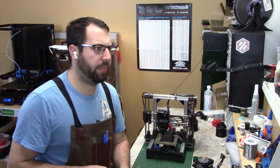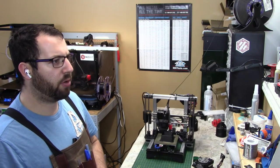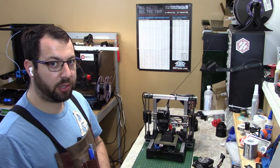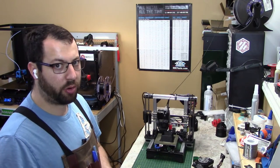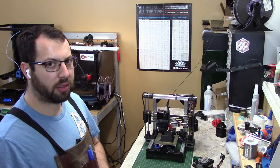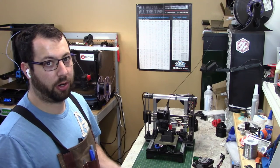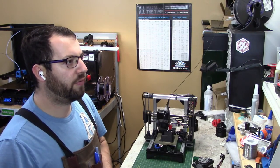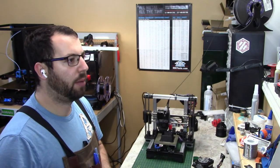Should I upgrade my Prusa Mark III Bear clone to switch wire or save up for a V2.4? Upgrading it to a switch wire, which is an upgrade, hardware-wise, isn't much. It's mostly printed parts and bearings. If you're reusing your bed, you would need to buy linear rod or linear rails, but you're buying some good hardware. It's not as expensive as building a scratch build V2. And it gives you a good introduction to building your own printer, an introduction to the whole Voron ecosystem of printers. And you learn Klipper on it and all that stuff. So if you already have a Prusa, or a clone at least, that you are willing to hack up, I would start with that.